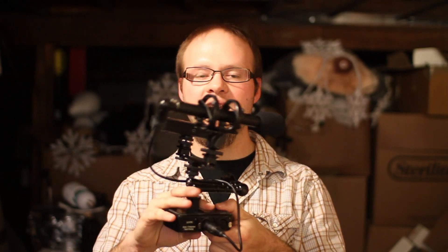If you're patient, you can pick up one of these passive XLR adapters on eBay for between $20 and $50. They're a great way to add XLR capability to something like the Tascam DR05 or the Zoom H1. If you're still not getting enough volume level out of your microphone into your field recorder, the Fiio E5 is definitely a great choice for adding gain to this otherwise passive device. In combination, you can really get some great audio if you set it up right.